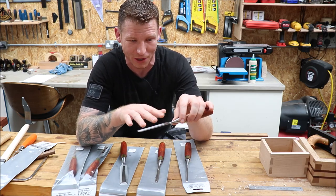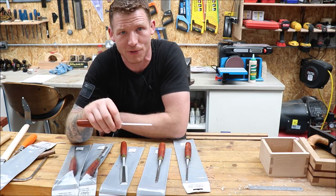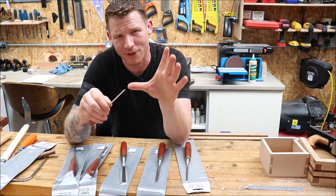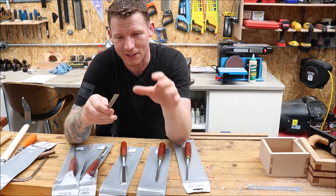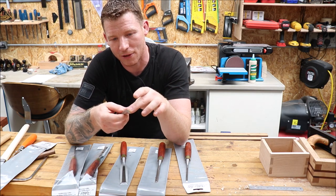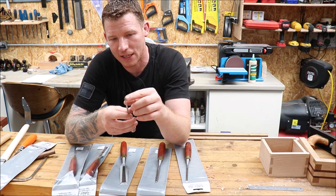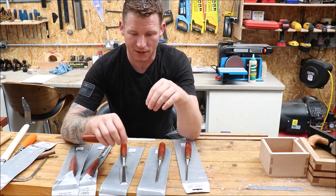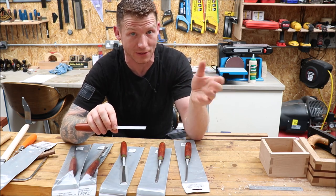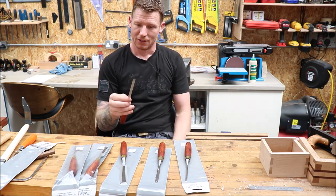The idea is you start from slightly concave and work your way back to flat, with two points of contact behind the back of the chisel. They say it's the correct way to sharpen a chisel. If you place a chisel on a perfectly flat surface and try to transpose flatness to flatness, you actually end up with a slight convexity at the back of your chisel. So the ideal thing is to introduce a slight concave back, have both points of contact — one at the back and one right at the cutting edge — and work from slightly concave back to flat. That guarantees you're nice and flat.